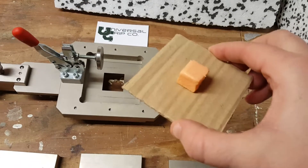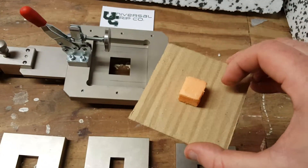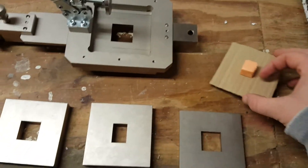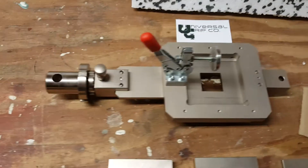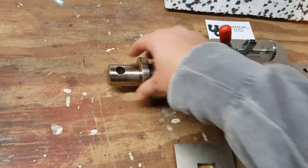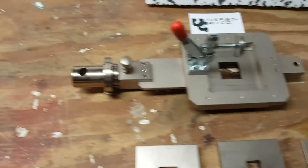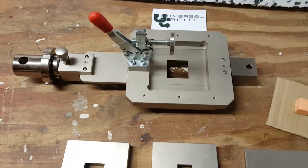There's a 1 by 1 inch block that's adhered to the substrate, so I just have a simple sample here. This attaches onto any universal testing machine by means of the clevis pin style adapter. Here I have the DM fitting, which is an inch and a quarter with a half inch locking pin.